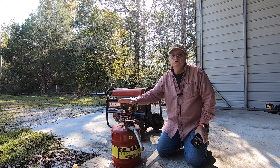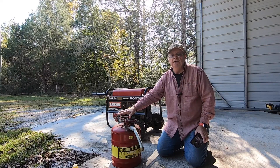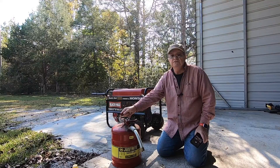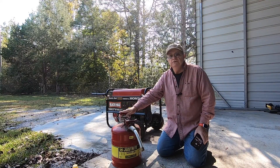So it's good to use non-ethanol gasoline, which doesn't leave that residue in the carburetor. I do use a fuel stabilizer — usually Stabil — and it works real well. Using the correct fuel is going to ensure that your generator and any small tool is going to be in tip-top shape.